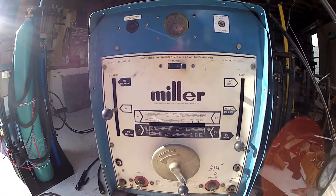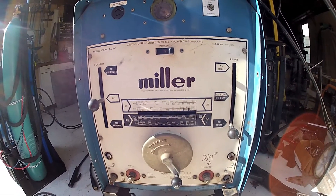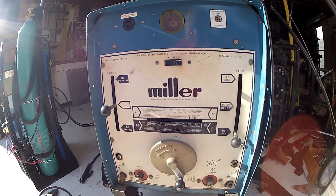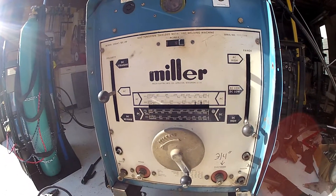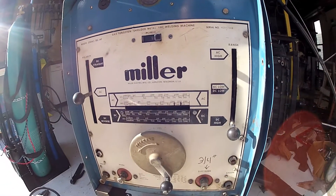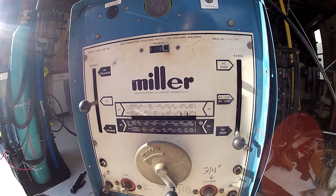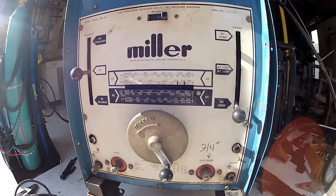I had a little bit of a fire in the old Miller TIG machine. I searched the serial number and came to find out it was built in 1974. It served me well for a lot of years, but I was having increased difficulty welding aluminum. And the job that finally burned it up was a heavy aluminum antenna mast made out of quarter inch. I followed one weld after another and probably exceeded the 40% duty cycle on the machine.